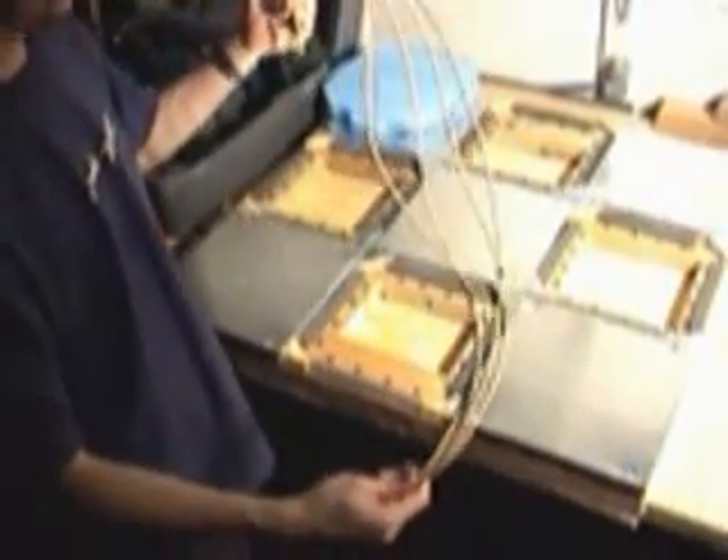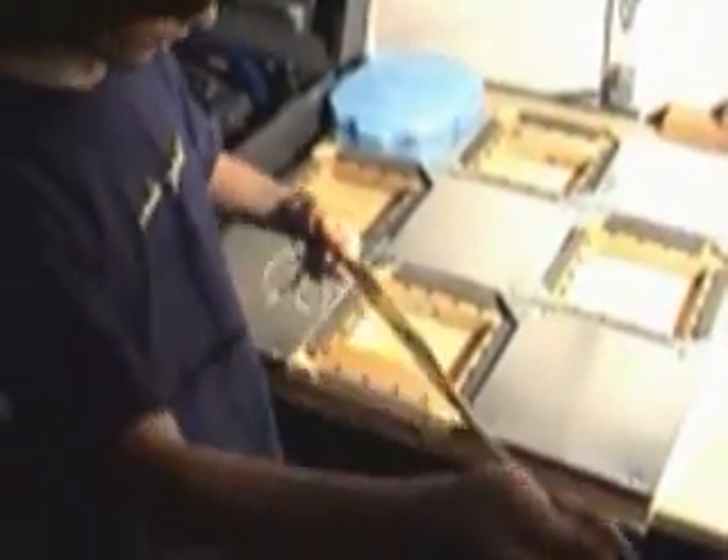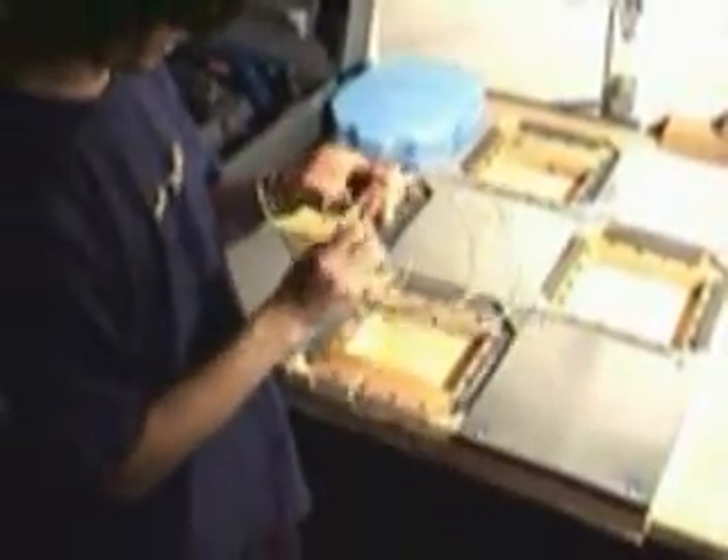What I have here is two links of phone cord — two actual cables. Each of these have six strands in it, and you are going to need two strands for each arrow panel, so that would make eight. The length of each of them is about twice the length of the pad itself. If you go across the pad it is a little bit longer, a few inches longer than the length of the pad.